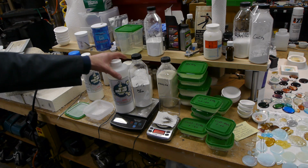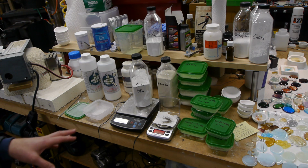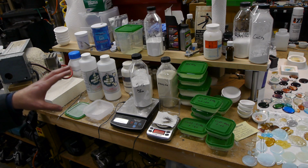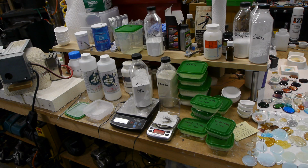One benefit of borosilicate glass is that it is less sensitive to temperature fluctuation. Like you don't want your glass to crack if you're heating up a test tube or something like that. And similarly, if you're making glass on your own, you actually don't want it to be very temperature sensitive because you're going to have to cool your piece of glass down from kiln temperatures all the way to room temperature. Annealing is the process where you pick a temperature and hang there for a while to let the glass relax and all the stresses dissipate. It typically takes hours for this to happen. With borosilicate glass, you still have to anneal it, but it's less sensitive than a non-borosilicate glass or something that's more sensitive to temperature fluctuation.